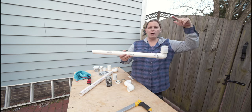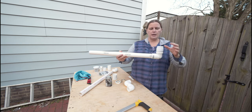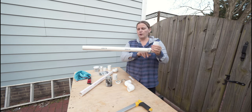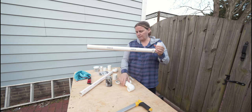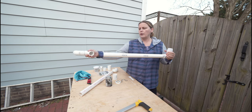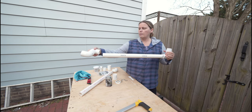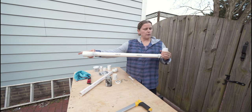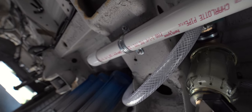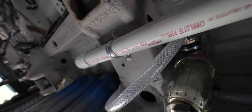The shower is coming through the floor of the van — this piece connects to that and then runs over towards the tank. We don't have a straight line to the tank inlet, so we made a little elbow to make that turn and then it goes straight into the tank. Our PVC is now plumbed from the shower all the way to the reservoir tank.